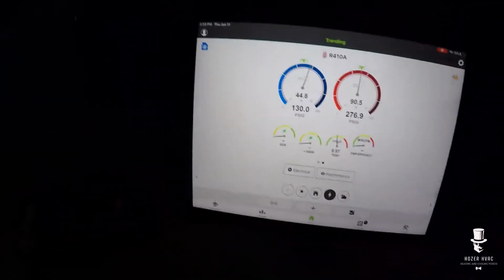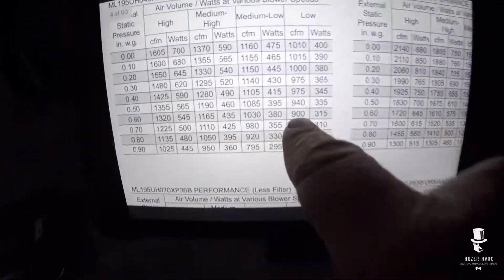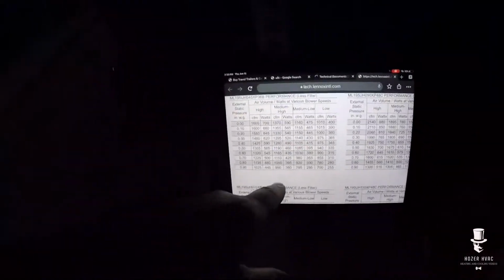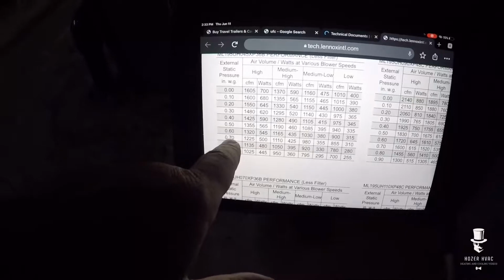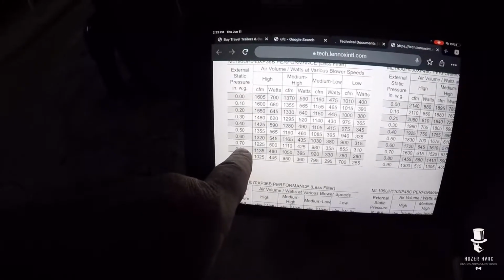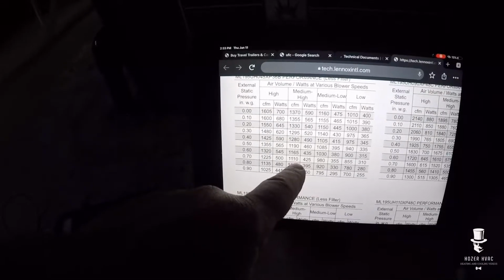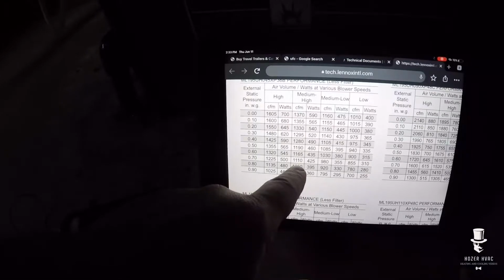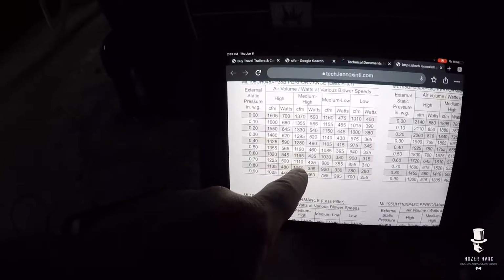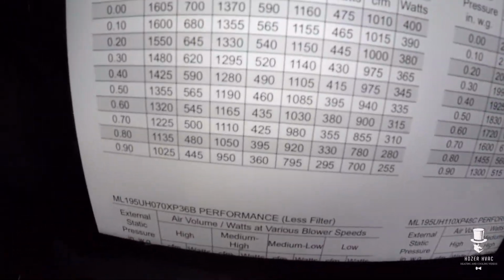So we got 0.58. Go to my blower fan, 0.58, right there. So I'm gonna keep it on low. That's about the best we're gonna get. I would imagine what it was on was at least 0.7, if not 0.8 at medium high on a 1.5 tons. That baby was pumping out close to, you know, 2.5 to 3 ton, which is not gonna do very well for them.